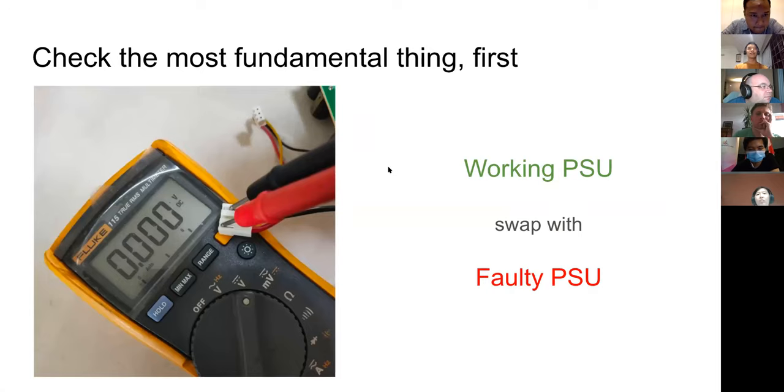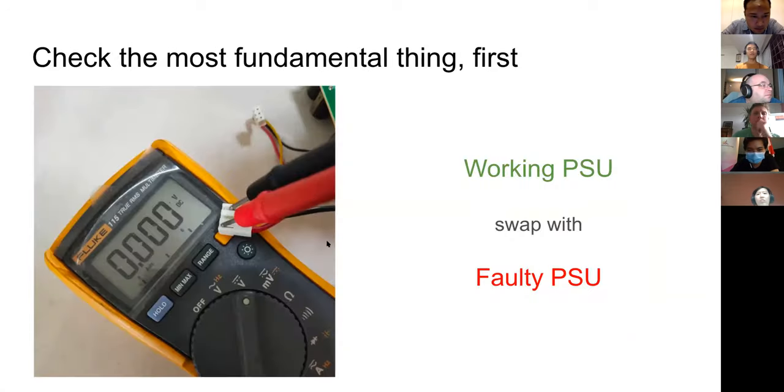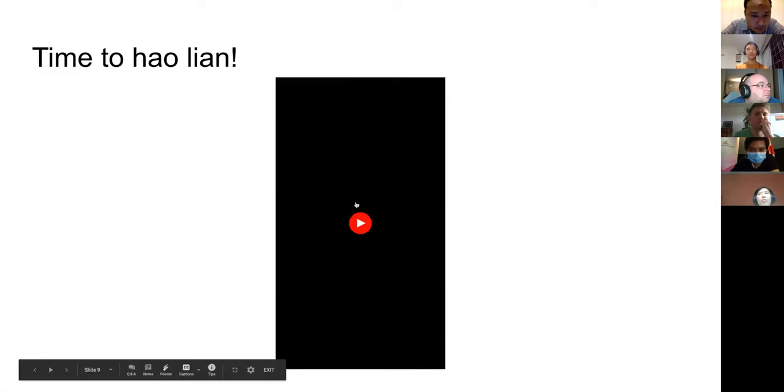I took the pictures, opened it up, and realized the power supply is not working. The right side is an AC-DC that gives 32 volts to the motor controller board. I did the fundamental check — measured to see if there's even power — and quickly realized the PSU is not working. Good thing Tim gave me two sets of controllers. The new one has a working power supply, so simple fix: just swap it.